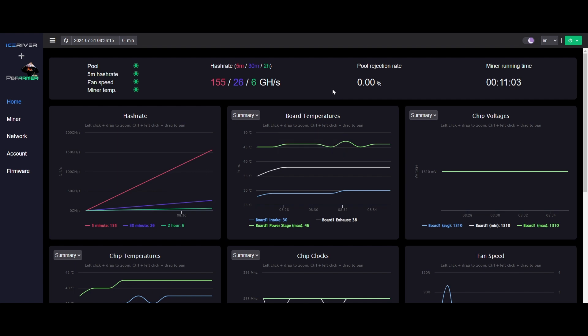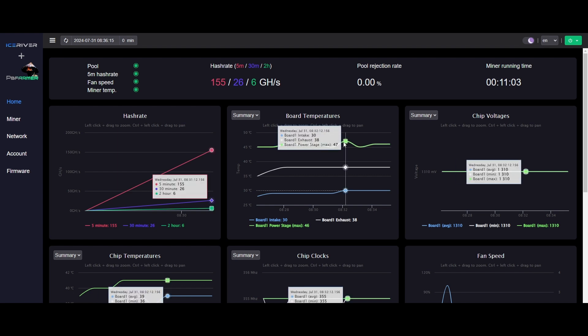The max these power stages are rated for is 125 degrees Celsius. I don't like to push it that hard. I'm overclocking this in a room temperature room — about 75°F — but my final destination for this KS0 Ultra is a hot garage that can get up to 90-something degrees. You might want to overclock these in the environment they'll permanently be in. I usually shoot for the 110s to as high as 120, and I don't like to go over that — that's just my personal preference.